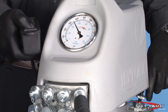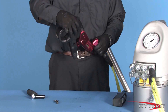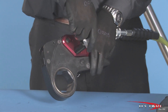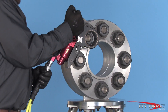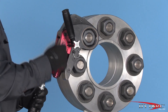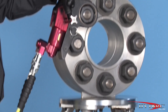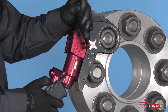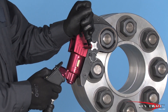With the pump set at 3,400 PSI, we are ready to go to work. A 2 3/8 inch ratcheting hex link should be attached to the XLCT4 power head, and the safety handle should be attached. Place the tool onto the nut in the tightening direction, checking to make sure that the reaction point is secure, the wrench is fully engaged, and the hoses are not in danger of being kinked or damaged. It is a good idea to bump the control button before starting to tighten, just to check how the wrench will react under pressure.